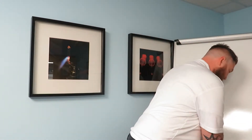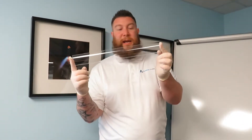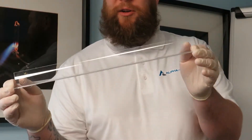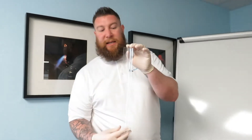A clean reflector would look something like this, whereby you can see fully all the way through. You should get a coating light, usually a dichroic coating, which helps to reflect the UV better. So long as these are kept in good condition and maintained well and cleaned regularly when you have your system down for maintenance, then you shouldn't have many issues with the reflector.